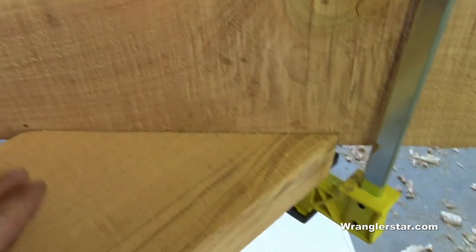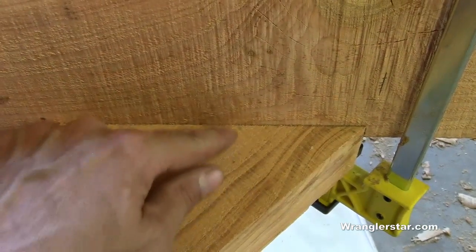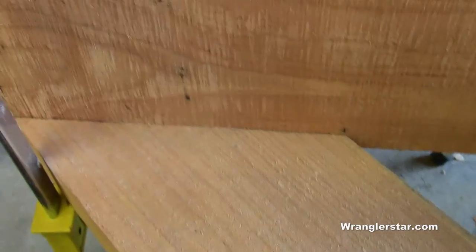That's something to look out for — same thing with your knee braces, anything where you're going to be doing chiseling work. If it has a big knot on the end, no good. If there's one in the middle, no problem. We've got nice clear straight-grain wood, which is a delight to work with and very predictable.